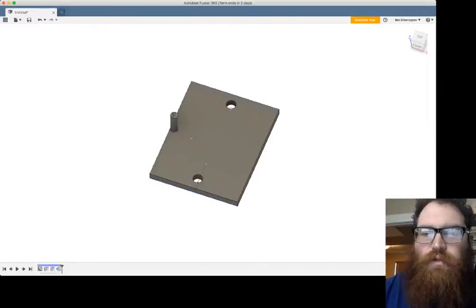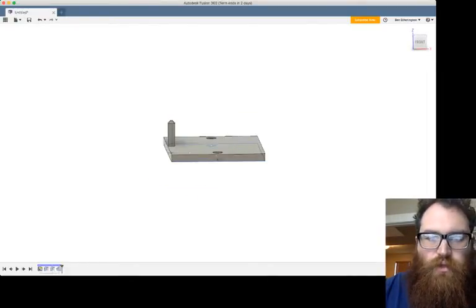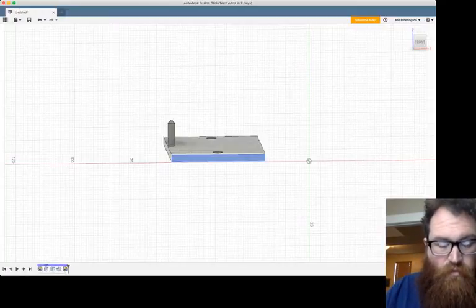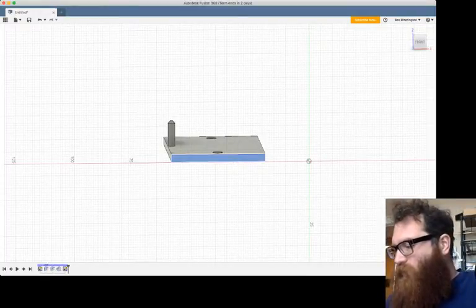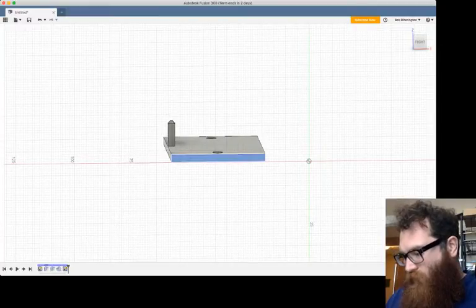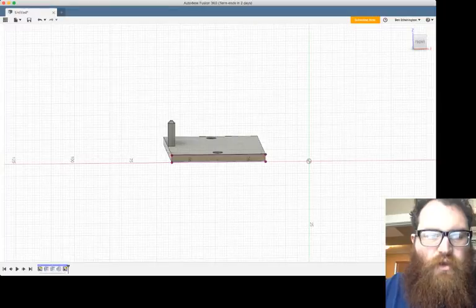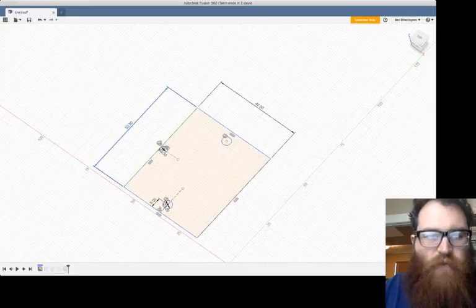All right, so let's start with the arms, and we can put the hands on top of them. So I'm going to make a new sketch in this plane. I want to project this rectangle, because we're going to have to connect to that and then avoid the breadboard. Maybe I need to make that guy a little taller, or wider, because my breadboard is 51 millimeters. I made this 50 millimeters. And if I want these arms to go around it, we might as well make this board a bit bigger. So let's call it 55. That way we'll have plenty of room.